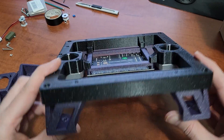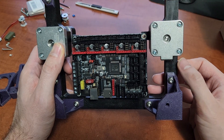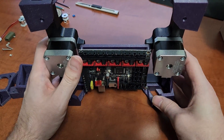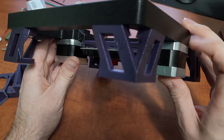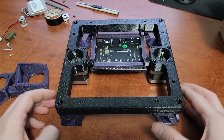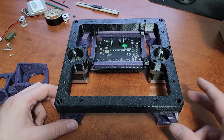After the motors, you can attach the feet. The feet are held in with M5 by 10 bolts that thread directly into the plastic — no nuts needed. The bill of materials does list rubber feet available on Amazon or AliExpress, but because I'm using shorter motors I'm just going to run some double-sided tape on the bottom instead, which saves a little extra hardware.